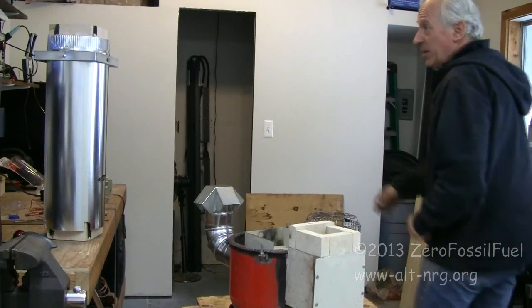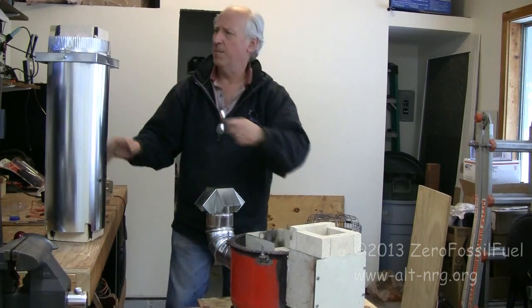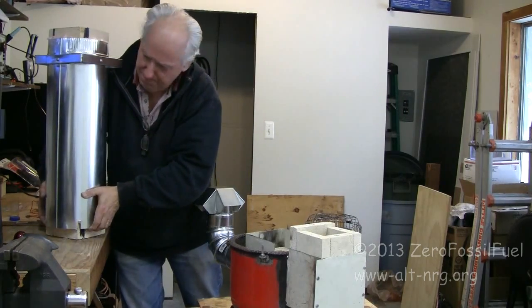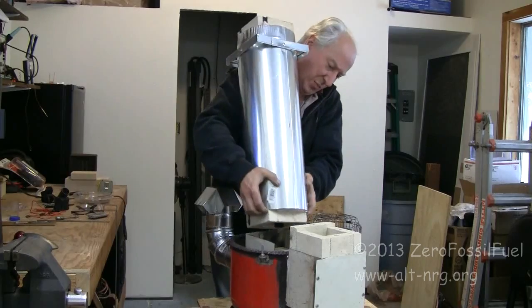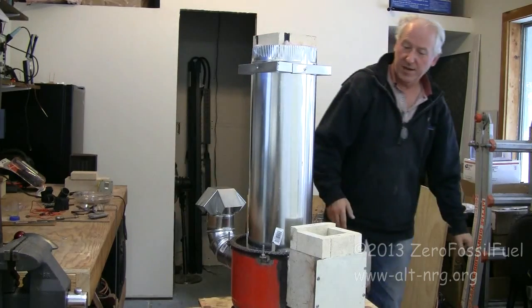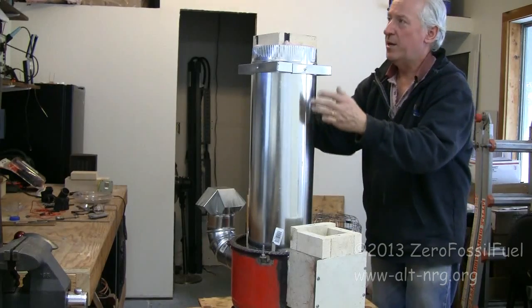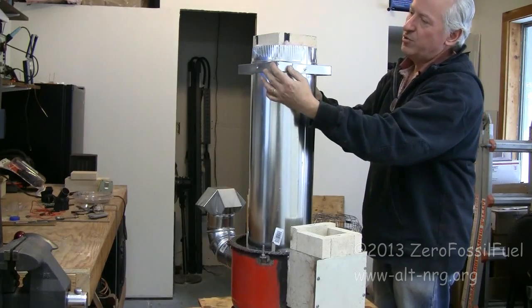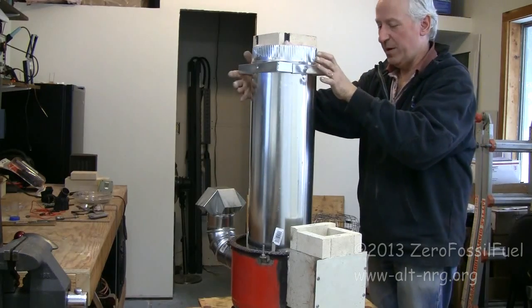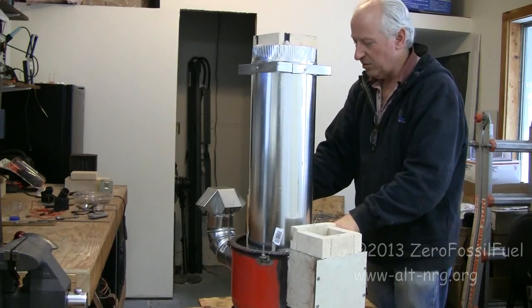The lower half of the firebox is completely assembled. All that remains is to set the pre-assembled flue stack. I also have the edges notched out for the lower firebox. I'm just going to lift it up — this is very heavy — and set it into place. The flue stack is aligned, made captive by the box down below. You'll also see that I have a metal strap at the top with the corners protruding out just under 2 inches from the outside edge of the 8-inch flue stack. Then the top half of the barrel simply goes on top of this and sets against the fireplace glass rope that seals the two chambers together.